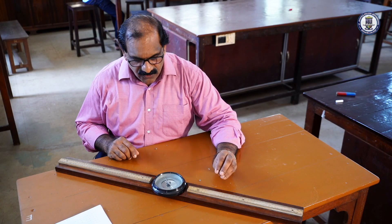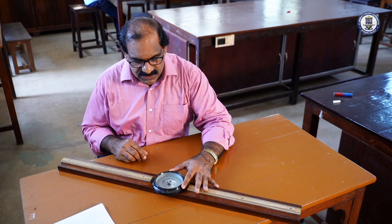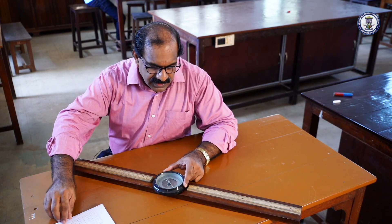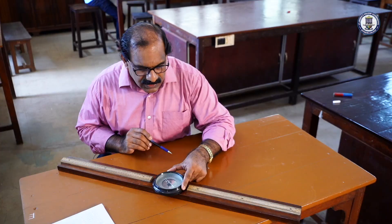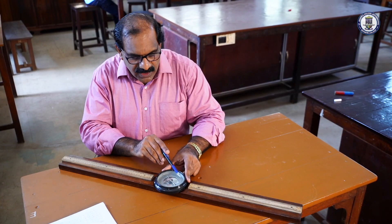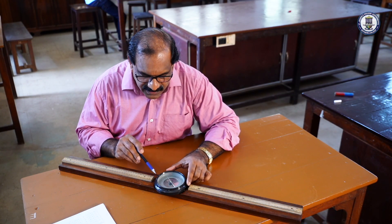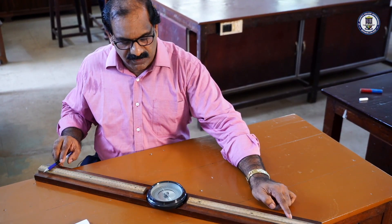In tan B position, we need two adjustments. The first is rotation of the compass box, and the second is rotation of the wooden board. Initially, the compass box is rotated such that the 90–90 line — one 90 on one side and the other 90 on the opposite side — is parallel to the arms of the deflection magnetometer. So one 90 is coinciding here and the other 90 is coinciding on the other side, making the 90–90 line parallel to the arms of the deflection magnetometer.